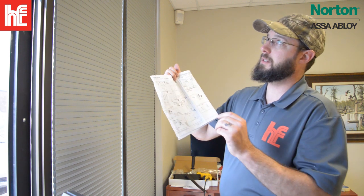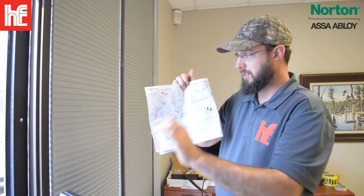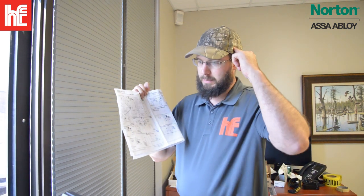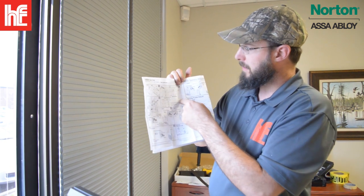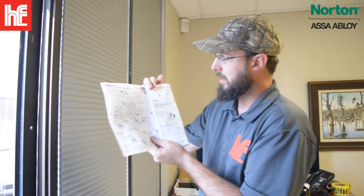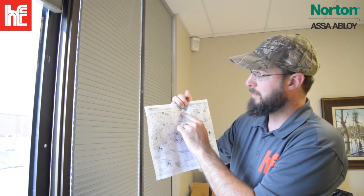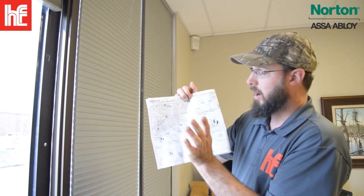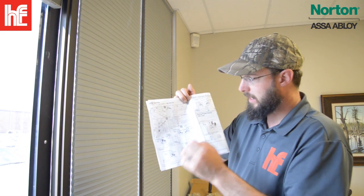We're going to be mounting this similar to the way that the old one was mounted, but we're going to be using the exact specific measurements that go to this unit, and that is 6 on 6. The reason I say that is it's always burned into my brain anytime I use this closer: from the top of the door and from the hinge line, from where the hinges actually pivot, to the first hole on the closer is going to be measurement A. If we do the 101 to 120 degree operation, that is going to be 6 inches. That is the most common and the easiest one to remember.